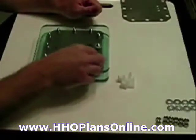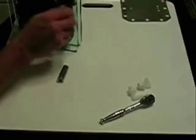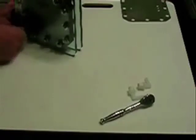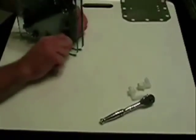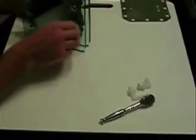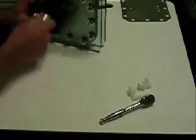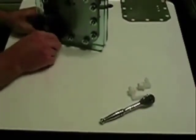Come back and put washers — you can use lock washers but I'm using small fender washers for now. When you're torquing these — I'm just doing it hand tight right now — make sure you do it in a star pattern, like you would when changing a tire on a car. That ensures you're getting even pressure all the way around. You don't ever want to over-tighten this material for a gasket, as you're liable to damage it — and that's nothing you want when filling these things up with electrolyte and having to tear it back apart.